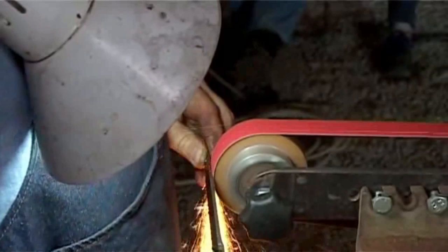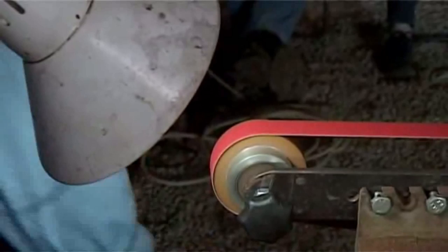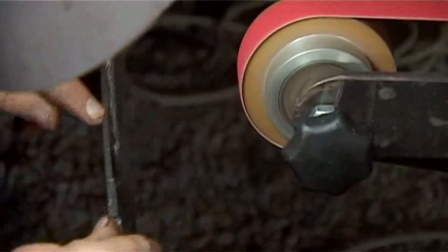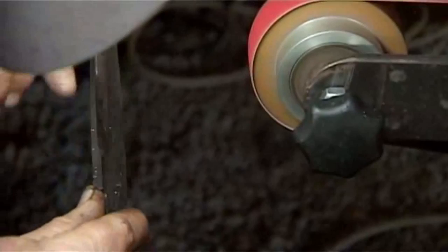Something I often see on daggers is that the cutting edges don't come together soon after the plunge. The blade thickness is very thick and the cutting edge is not sharp for a whole length down the blade. I'm not a particular fan of that. If you do it with intention, that's different. But in my opinion, the dagger should be sharp for the most of its length.